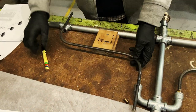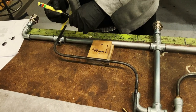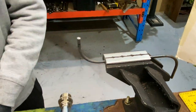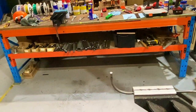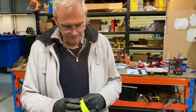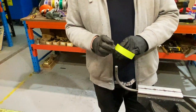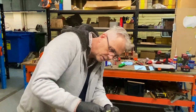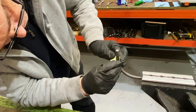Now it's been cut and trimmed to the dimensions. You might ask: why didn't we cut it to the right length in the first place? Because it won't reach across the two rollers - you've got to have something to actually push the bender. And if it's too short, it can be really dangerous if it flings out. So that was a pretty simple answer.